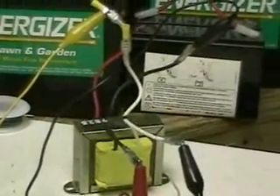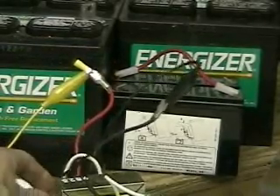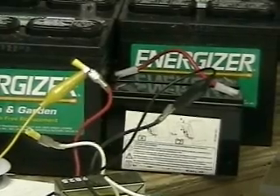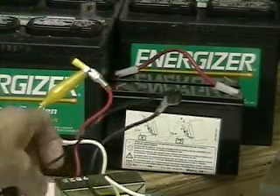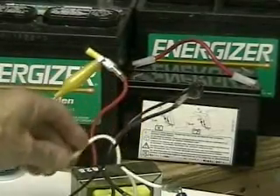There's a picture of the transformer. What I've done is reverse this transformer. Normally you'll be going in through that black and white lead. What we're doing is going from the 12 volt AC into the secondary leads there, and coming out the black and white lead, going through the diode to the capacitor.